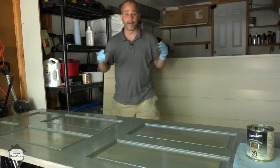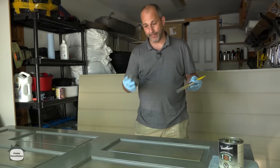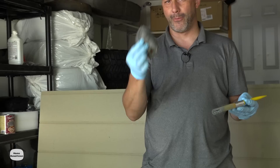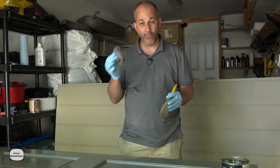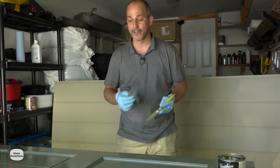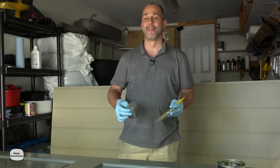One more application you have after this is all dry: come by with your steel wool — I like to use the 3-0 or 4-0, usually in the paint department. This is used to buff an oil-based finish and gives it a glass-like look. The finish might be satin or semi-gloss, but this will make it incredibly smooth and very easy to clean. If you're not happy with the consistency after one coat, you can do a second application — sand with the steel wool first, wipe it down with a cloth with a little Varathane on it, then do another application. But when you're done, always use your steel wool. This is more of a polishing than a sanding process, and you're going to love your finished look.